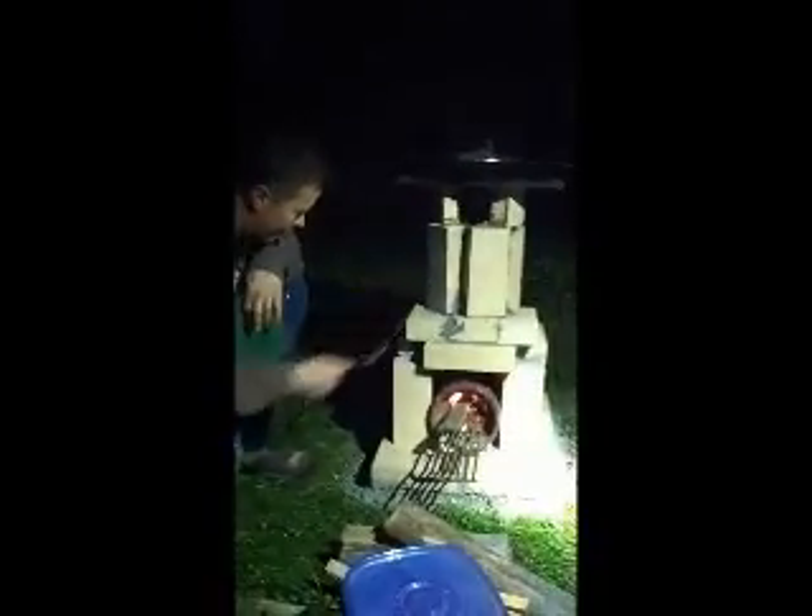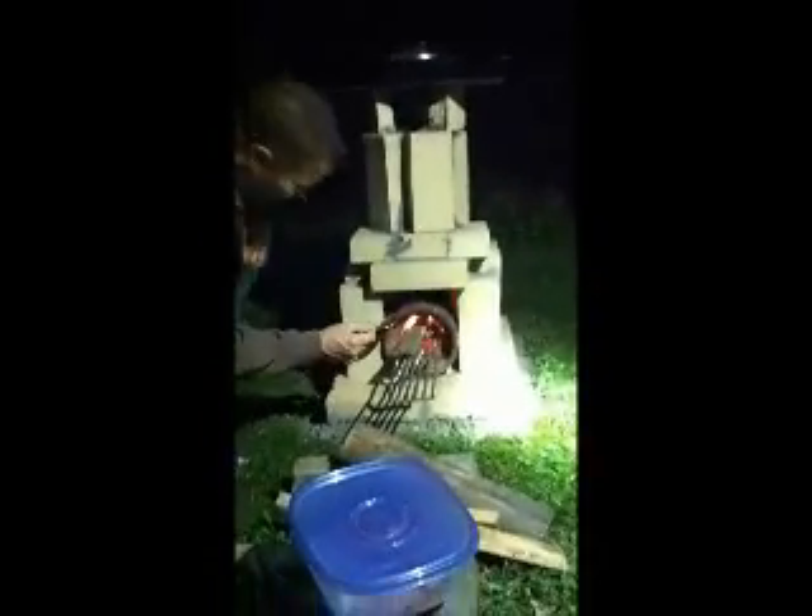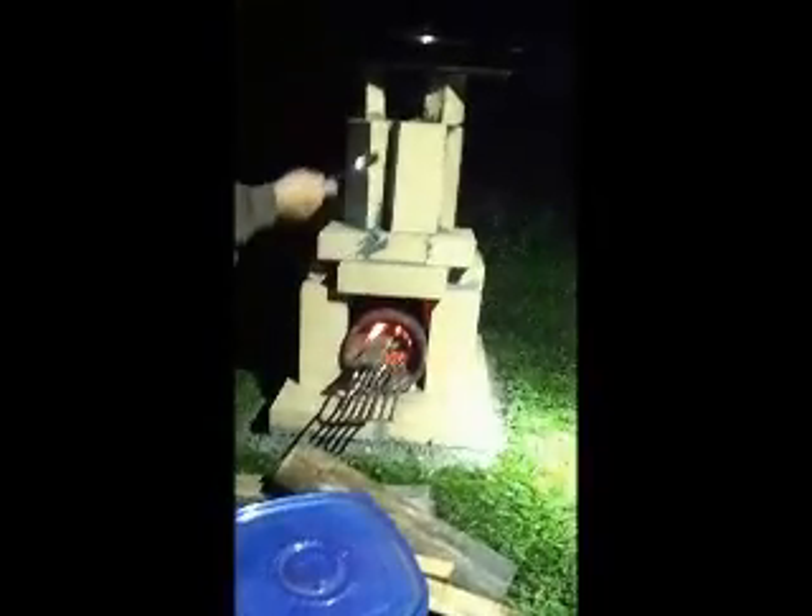I've got about 36 refractory brick here — fire brick — and refractory mortar. I poured a concrete base out of a Quikrete concrete one-bag mix from Lowe's. I've got ceramic pipe and an elbow that joins another one that I mortared together, then set it all on top of this base with brick surrounding it for insulation.